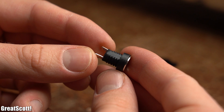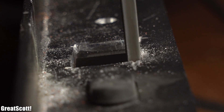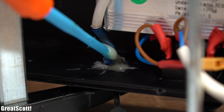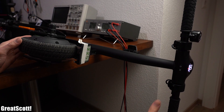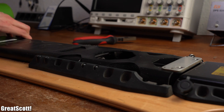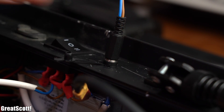So I came up with another plan, for which I used a decent DC jack and a proper switch that can handle a bit of current. What I did was create two holes in the side of the electronics box, and then connect the battery pack, motor controller, and DC jack to the switch according to a wiring diagram. After using two-component adhesive to secure the extra components to the box, my small range extender modification was complete. Now in switch position 1 the built-in battery pack powers everything like usual, but in position 2 you can hook up an external battery pack through the DC input jack. This is useful since I got a spare electric skateboard battery pack, and by simply adding a wire with a suitable plug I can place it inside a backpack and use it to power the scooter in emergency situations.